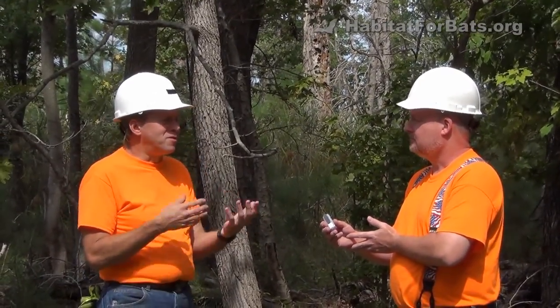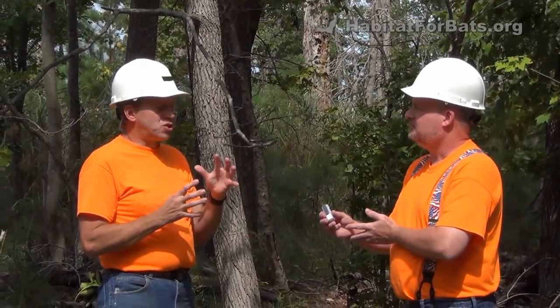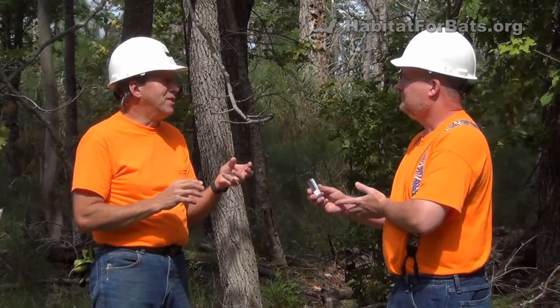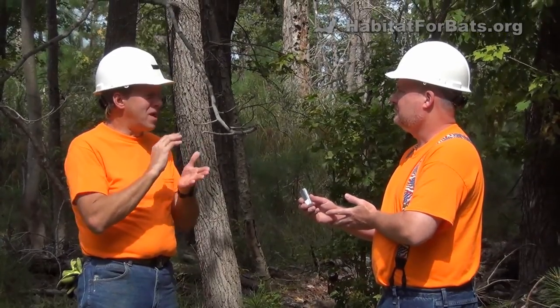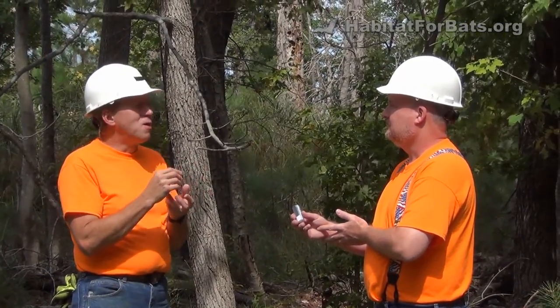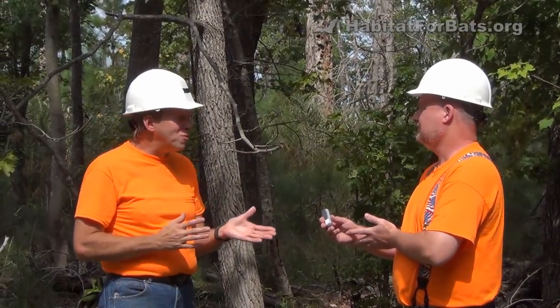They take very minimal maintenance. Even when you put up a bird house you have to go in there and clean it, paint it, and repair it if it gets some cracks or knot holes that come out. Same with a bat house — you want to make sure the structural integrity is still maintained, that there are no gaps in the wood joints. If the wood starts to warp, we need to repair and caulk that and repaint it. We should repaint it every two to three years at most, because weathering sets in and that helps protect the wood, keeps decay from setting in, and makes your bat house last longer.